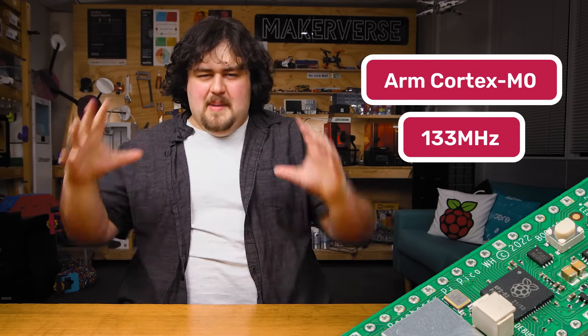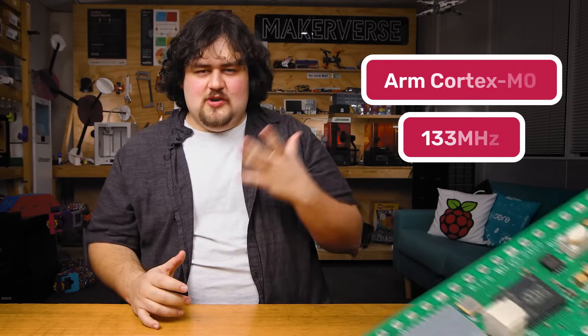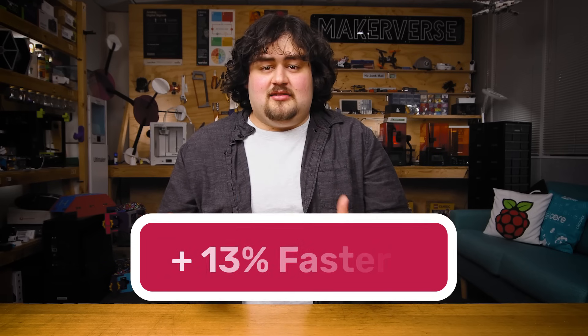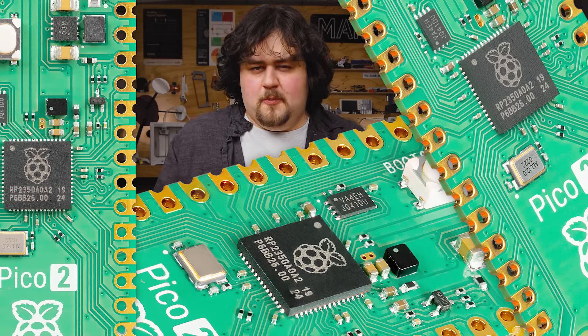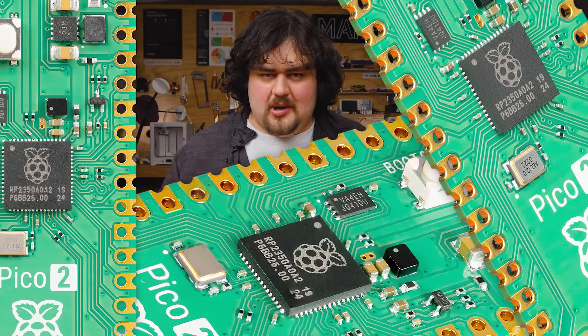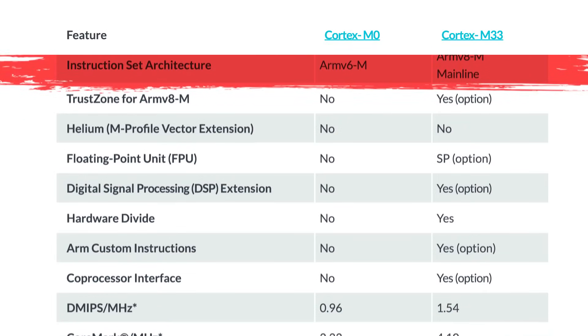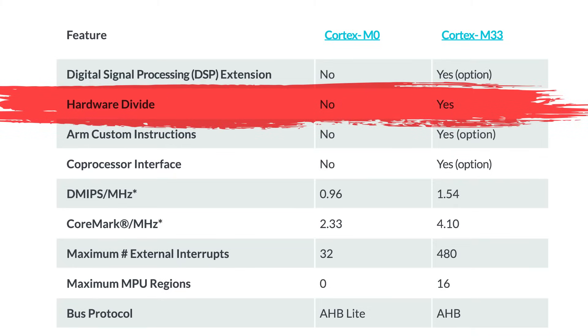Let's take a look at that brand new processor, the ARM Cortex M33, which comes clocked at 150MHz. The old M0 Plus was clocked at 133MHz, and while 150 is only 13% bigger than 133, this might not mean it's only 13% faster. The M33 is a more advanced and capable processor with a lot more going on under the hood — things like a richer instruction set and dedicated computational hardware like a divide unit means it can achieve more with fewer hertz.